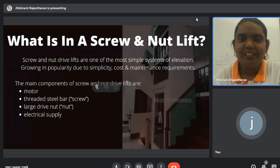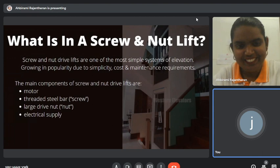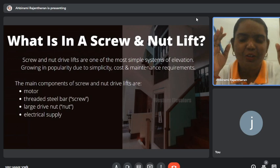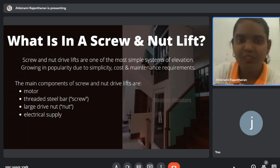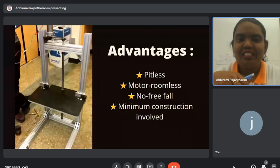The lift car seat sits on a long screw, and the motor is mounted onto the lift car. As the motor runs, it screws up and down. Basically, there's a long screw and a big nut attached to the platform, and the screw drives the platform up and down. As you can see, the screw rotates the nut, which brings the platform up and down.